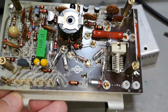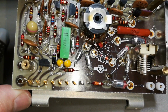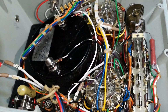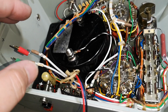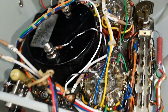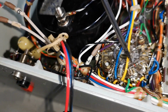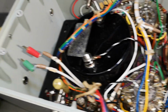Or there's a leak somewhere because of this white powder, this acid. Try and imagine the whole cabinet was full for like 20 years with acid fumes that just put a tiny little layer on everything here. And we're talking about 200 mega ohm circuits with a tiny little bit of acid stuff all over the place. So of course you can imagine that this is why nothing works. Maybe nothing is broken, but it's just not working because of a leak.